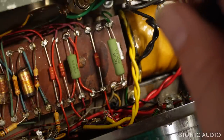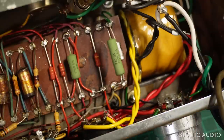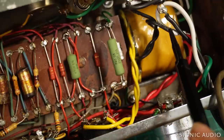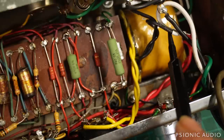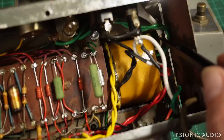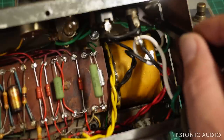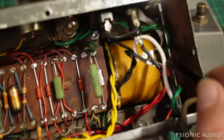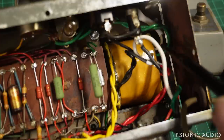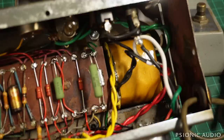Separating the reservoir ground and the center tap for the HT secondary from everything else usually gives a nice lowering of noise. One of the other issues here — you can see I've got one of the primaries connected to neutral; that's all insulated off. And over here you can see this white wire, which is looped on itself with heat shrink on it — that's the heater center tap wire on this transformer, so I've tucked it away insulated.